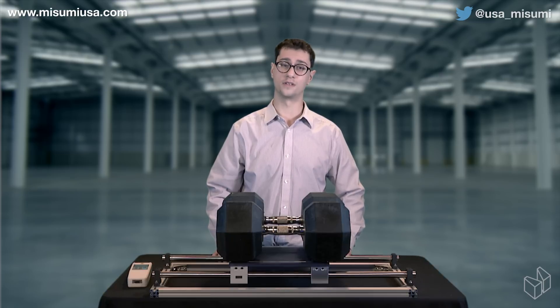This is why you see a slightly larger rolling resistance when compared to chrome-plated and 52100 bearing steel shafts. It's a little different with rolling ball bushings — smoother chrome-plated surfaces actually improve the motion, and that's why you see a lower resistance.